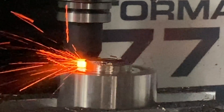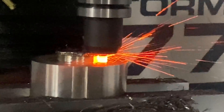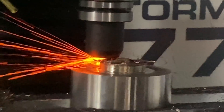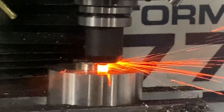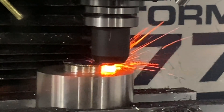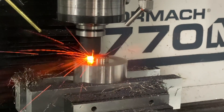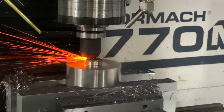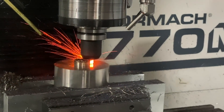At the end of the day, it comes down to your material removal rate — your MRR. You've got to look at due dates, when you need to get parts done, and the type of machine you have. If you have an advanced machine where you can run five different tools as tool one — run the first for a period, bring in the second, third, fourth — making the entire process efficient, then ceramics is amazing. If you have a machine that's not high-performance and you need to cut intricate grooves, then maybe ceramics is the key. But there are other applications that simply don't make sense, so you be the judge.